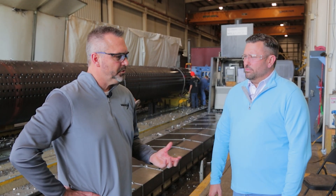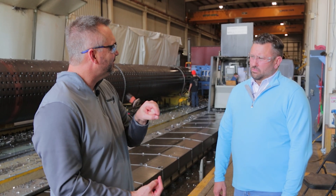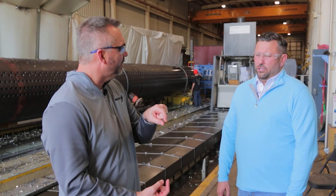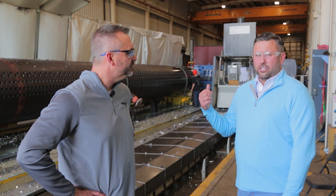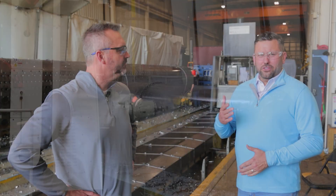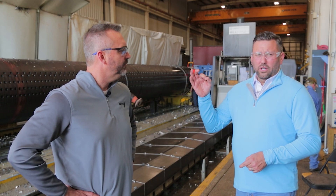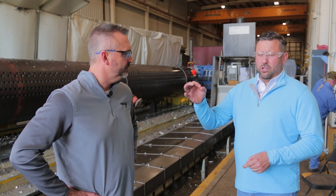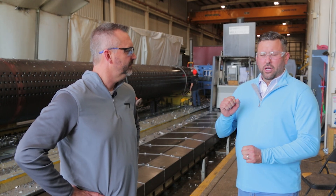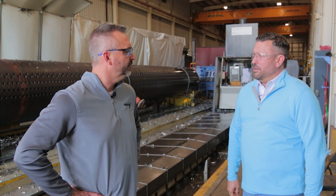It's just a better joint and a lot quicker, which is really important because when you're doing a steam drum and a mud drum, you've got to get things to fit up for the tube. With the accuracy of the way the holes are drilled, when you're tubing the boiler, that's all the difference in the world — assuring that that hole matches up from the steam drum to the lower drum, and that tube, when they stab that tube, it's going to be completely vertical with no misalignment.